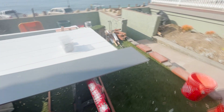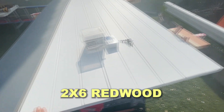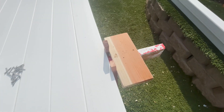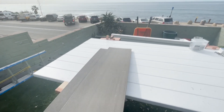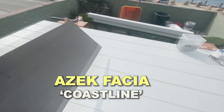Let me show you how I'm building this gate. I have eight pieces of two-by-six, primed and painted, and I'm clamping them together with a homemade clamping system. I put a two-by-four here and a two-by-four over here, then I cut some long shims — so there's no gap in between.